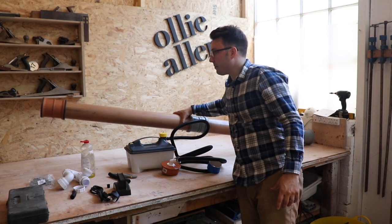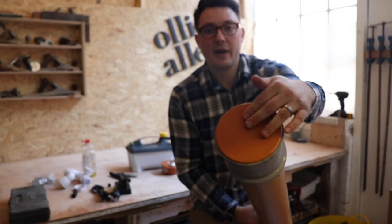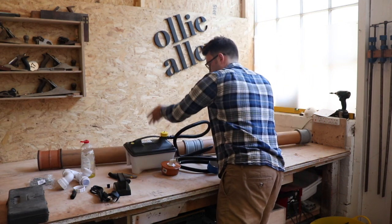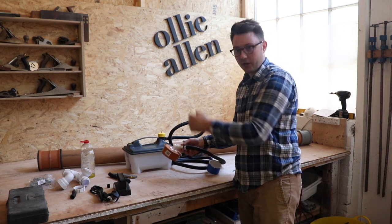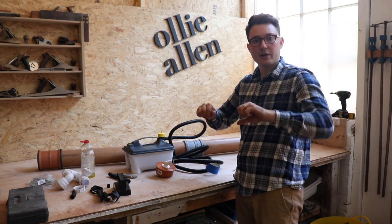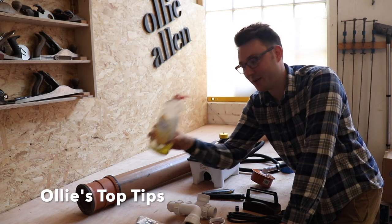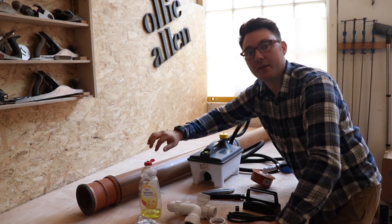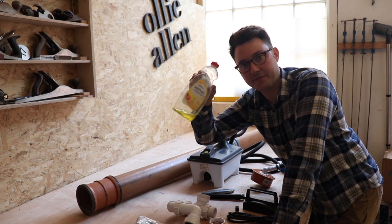I'm going to use some old soil pipe with a couple of connectors. I've put a stop-end connector in and I'm going to drill a little hole for pressure release. I've glued up this fitting so that the steam can travel through into the fitting and bung on the end, then jam the wood inside and heat it up 15-20 minutes — it should be nice and pliable and you can start bending it. A little top tip when working with soil pipe: use a bit of washing up liquid, squirt it all over the end, rub it around — it's enough lubricant to allow the fitting to slide together. Don't forget the washing up liquid.